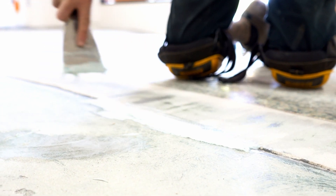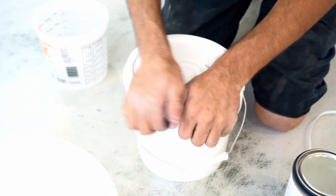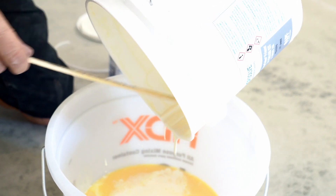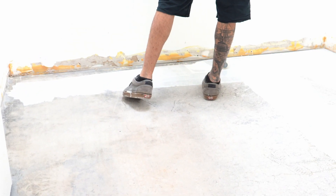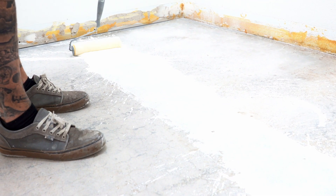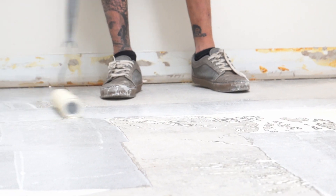Then we're getting our rollers ready for the sealer. Today we're going to be putting this vapor barrier on the concrete. This is going to keep all the gases and moisture and air from coming through the concrete before we put our epoxy down. So now we're dumping our concrete sealer — a vapor barrier — on the concrete and rolling it out. I like to cross roll all my products I put on the floor just to make sure that the product gets in every crevice and pore of the concrete. That way it gets a proper seal and no air or moisture is going to get through.